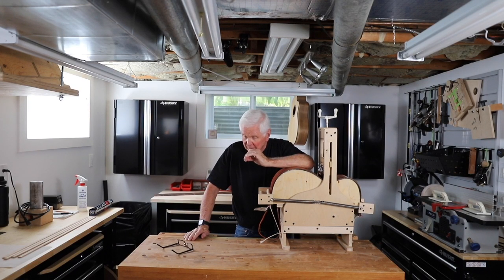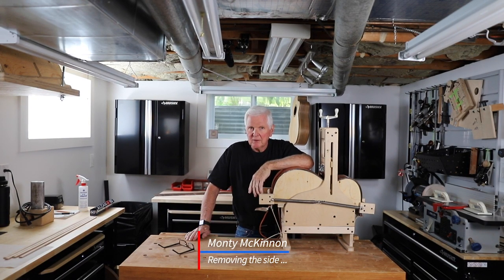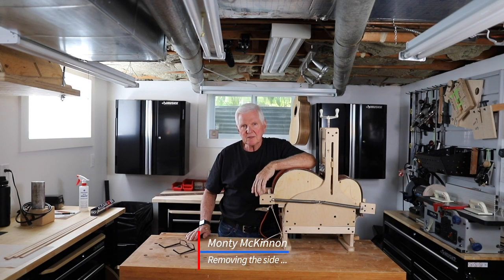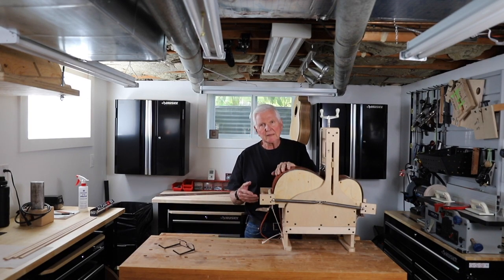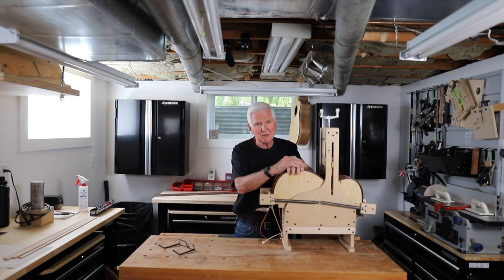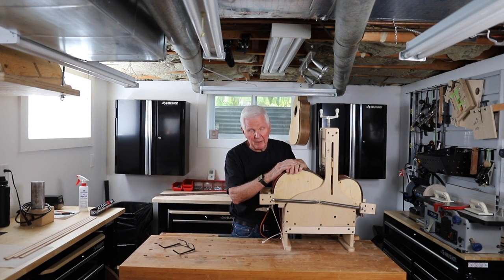This is the moment of truth. I'm hoping that everything went well — I don't see why it wouldn't. We did everything exactly the way we should have. We spritzed the side with some softener to make it bend easier, lubricated it with some water, although the water is more of a deterrent to keep it from burning. We heated it up — I was going to take it to about 275, we ended up at about 240 by the time we got the side bent.